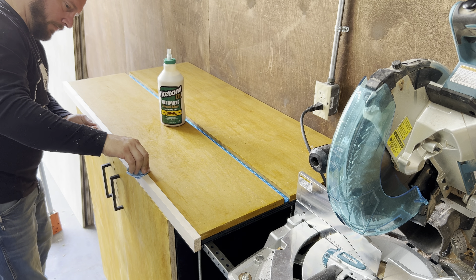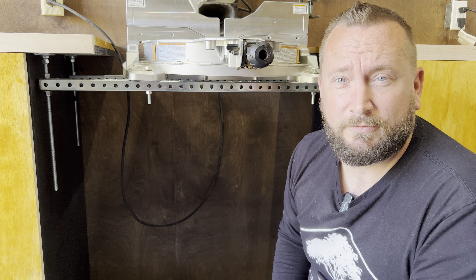For the sake of over-explaining, I really just wanted to detail out the way this system is put together. Up here you have the ceiling plate that's attached to the underside of the cabinet top. The threaded rod goes through the one-inch square angle, and then you've got one, two, three nuts on each one of them. So this thing is rock solid — it is not going anywhere. Thankfully those locking nuts really resolved that concern.